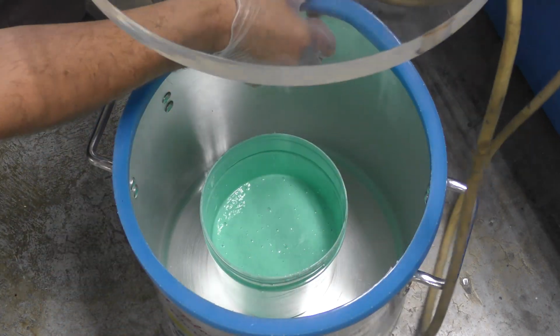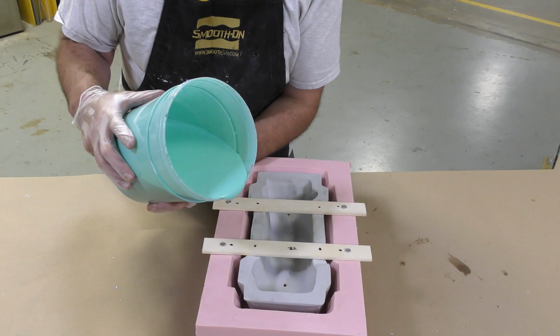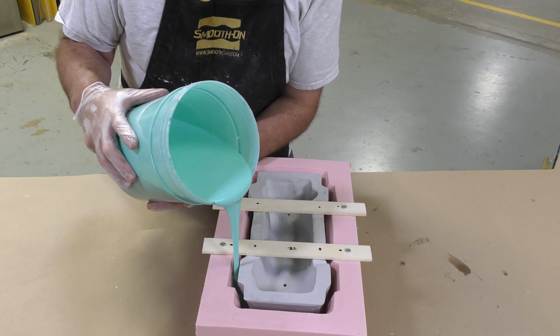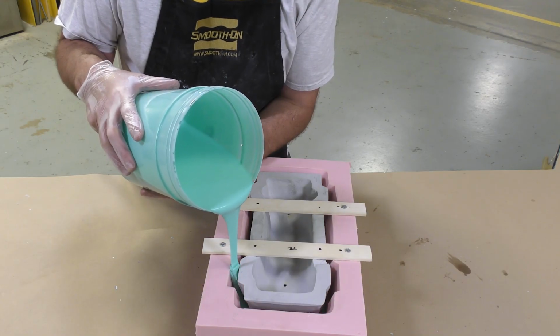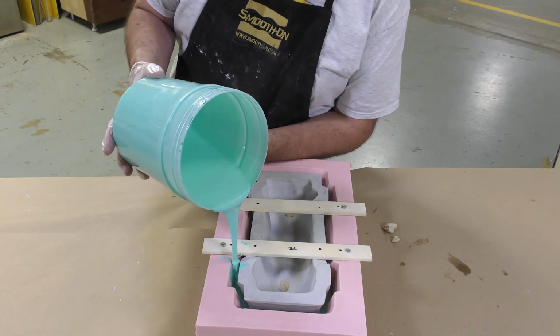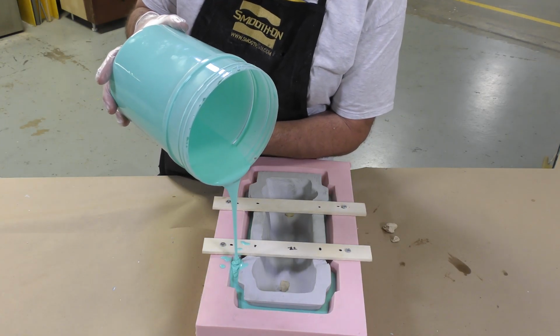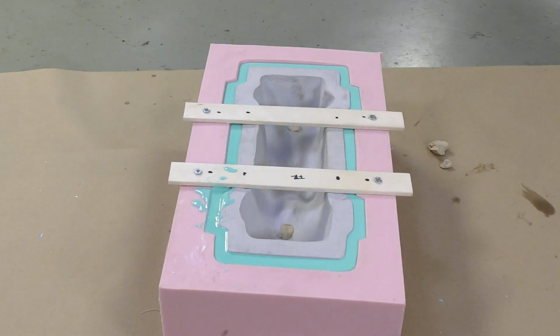The Smooth-Sil now can be poured into the cavity that we created between the silicone mold and the freeform air HT plug. And because we added the silicone thinner, the material flows quite nicely. And I'm going to plug those air vents. When I see that the silicone is rising out of them, I use a little bit of the Sculptex soft clay to plug those up. Again, once I see that the silicone is coming out. The rest of the silicone is now poured into the cavity. The material is now allowed a full cure of 16 hours before proceeding onto the demolding.